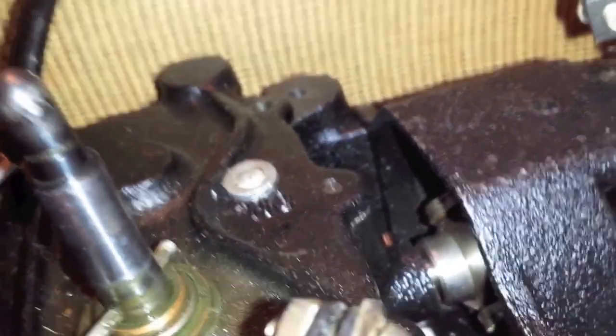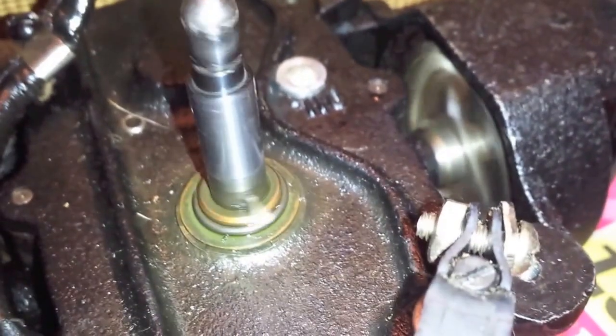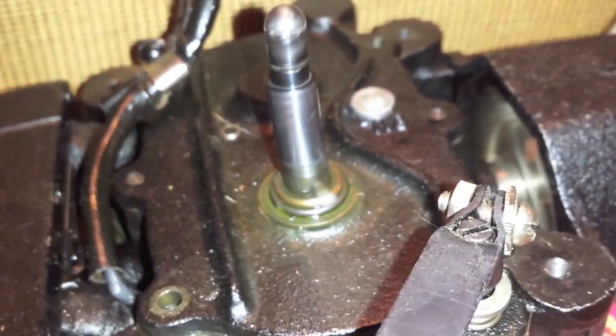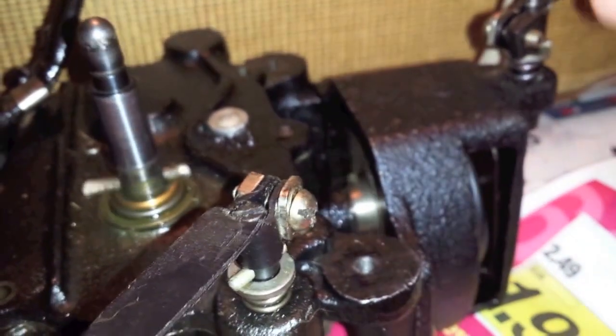Let's turn this on so you can see what's happening. You can see it turning — the centripetally controlled weights come back together when I shut it off, and spin back apart when I turn it on. By changing the braking pressure I can control the speed. It's a completely mechanically controlled braking mechanism. You've also got your drive shaft here — that sets between 33 RPM and, once I switch this, 78 RPM — back to 33 and 78.